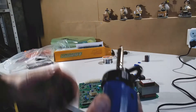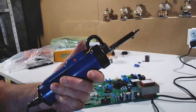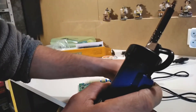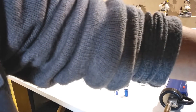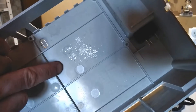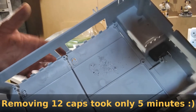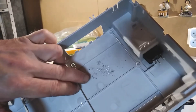There we go — that's the little solder sucker working. I'll plug it out now and let it cool down. It does spit the solder back out if you release the button while it's still over the board — that's just the nature of the pump. This here is the solder that's been spat back out. So you want to take it away from the board before you release the button, or it'll spit solder back onto the board.